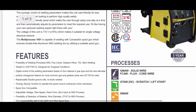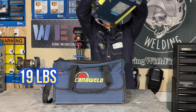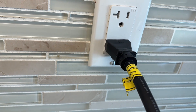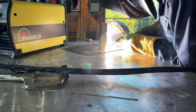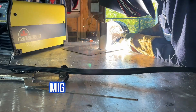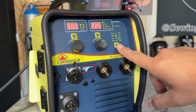I'm going to provide a bunch of technical information — you can always reference the manual. This machine is about 19 pounds, lightweight and portable. It plugs into a 110–115 volt outlet, which was designed for portability. It has an energy saving function and was tested to perform in conditions up to 40 degrees C or 104 degrees Fahrenheit. Welding processes include MIG, flux core, stick, and TIG lift arc on DC. It also has synergic controls, which feature automated adjustment for the less experienced welder.